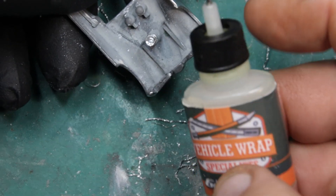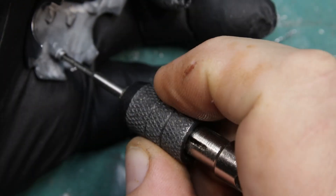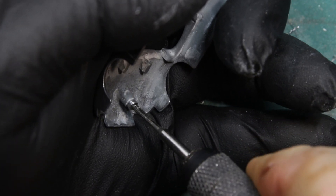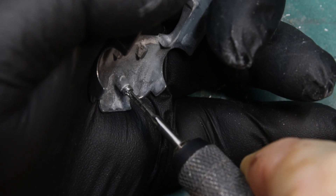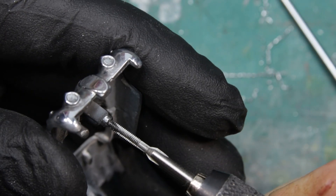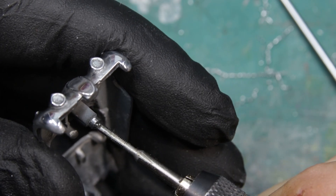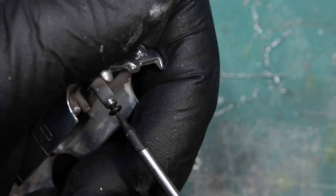I wanted to put it back together with button screws, so that was going to have to be done. That's why I'm wearing the gloves — I didn't want to do anything to the surface that I had already prepared. That's a 2-56 tap — I'm sure you've heard me say it before. I don't have a link to it, but if you go on Google and type in 2-56 tap, you'll get all kinds of places that want to sell them to you. Probably find it on Amazon too, same with the button screw. When you're tapping these things, you do have to be careful. If you feel it's starting to bind, you need to back out a little bit. Sometimes it's good just to do a little bit of back and forth when you're doing it anyway.